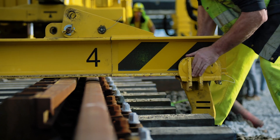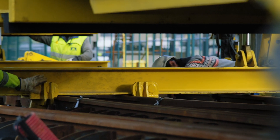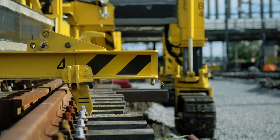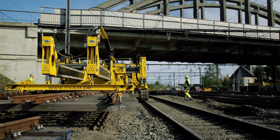The loading hooks are moved underneath the base of the rail and can be adapted easily to turnout segments with any layout. The lifting beams guarantee synchronised lifting and the ability to securely fix the load beneath the frame structure of the Technir Tracklayer.